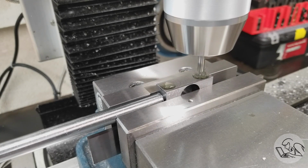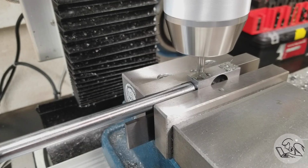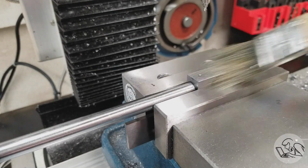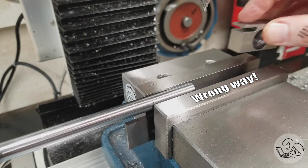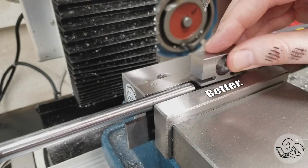Now, drilling these holes is going to be interesting because, as I said earlier, we have a very specific depth that we need to hit for these so that the drill breaks through at full diameter without impacting the flexure plate at the bottom. I don't want to leave a drill impression on that plate because that might interfere with the ability for the plate to slide however it might need to against the end of that set screw as it moves in and out.